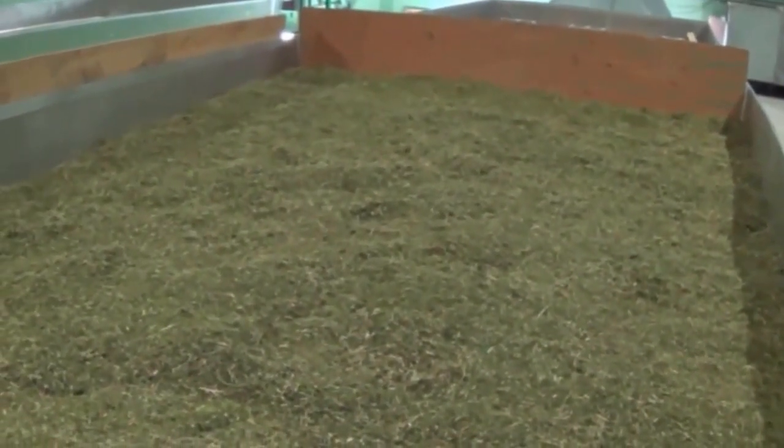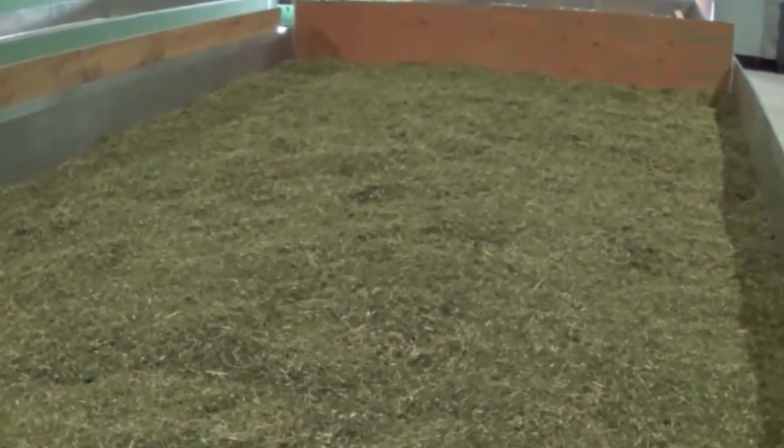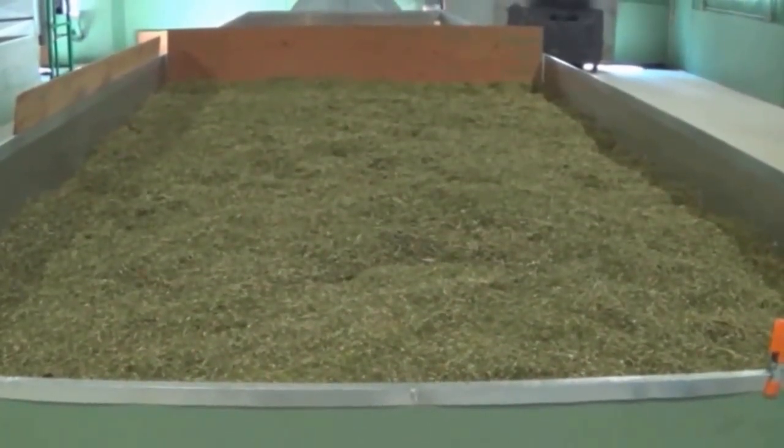If we put 2,000 pounds in the dryer, the water is all exhausted through big exhaust fans up in the top here. Each exhaust fan is pulling about 9,000 CFM and each dryer puts out around 6,000 CFM. So over a 48-hour period there will be over 1,000 pounds of water going through those exhaust fans. This load is not quite dry yet — it's got about two or three more hours.